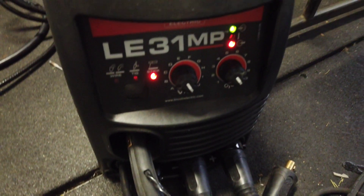I mean, you can see it — it looks okay. I had the machine maxed out on that 1/8 inch run. You're really going to be using stick in repair mode with this machine. It's not really designed to do any structural work with it; you can do thinner gauge steel and be fine using your 3/32 inch electrodes.